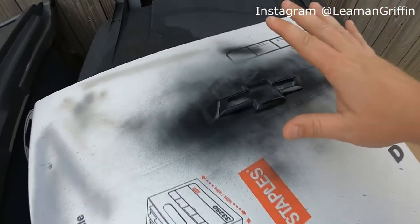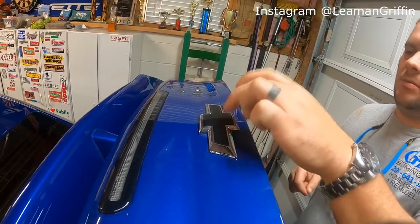The key to spray painting something like this is light coats. A lot of people try to get full coverage on the first coat and that ends up running and adding all kinds of weirdness to it. Light coat — just get some color on it, let it dry, sand it down, then come back with a second, maybe a third, maybe a fourth depending on results. Don't try to do it all in one coat.